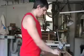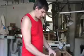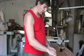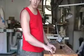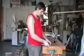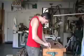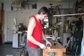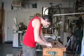All right, when you mark, you have to be careful not to hit the piece on the bottom that supports the piece that you're marking, because then the gauge will slide over it and do a bad mark. We have to be careful because the marking lines will show up in the final piece. All right? I usually do every line twice to make sure that it's marked properly.